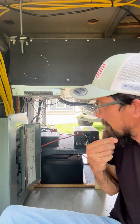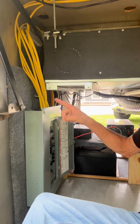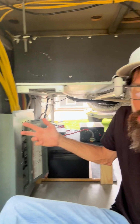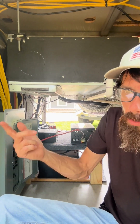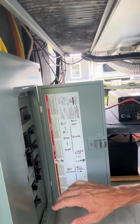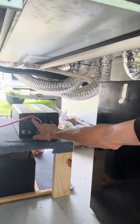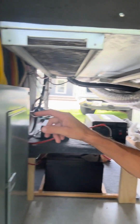The way I have this panel wired, when an inverter is active it's being fed by a sub panel that's basically acting as a manual transfer switch. Whenever we're connected to shore power we flip the 50 amp, and when we need inverter power we connect the 30 amp plug. It's only going to feed one side of this panel — where the refrigerator and other labeled circuits are. You just make sure you get one side of the panel hot. This is the 30 amp wire going over to feed the sub panel, which feeds this panel.